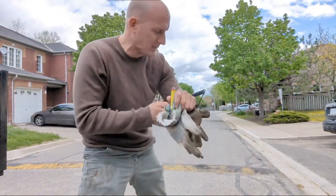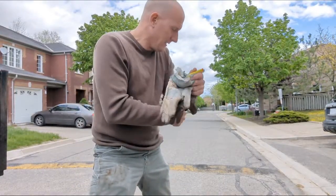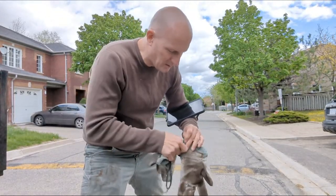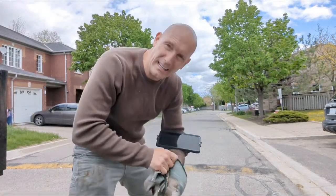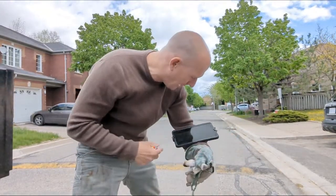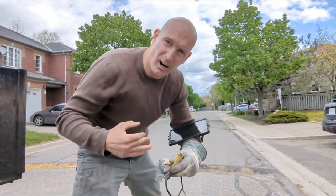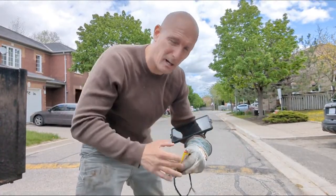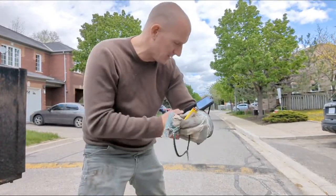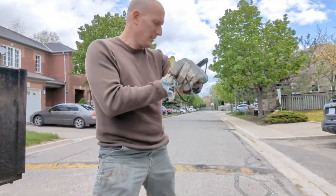I've got the comments here on my tablet. What this involves is using a propane torch to heat up the existing asphalt, shave the top layer of asphalt off, reform it, reheat it, and re-compact it with the hand tamper, and then we move on.